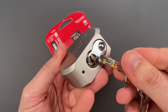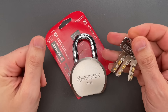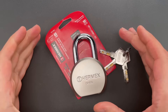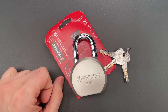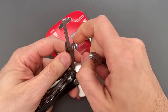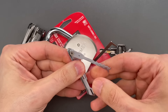But what sets this one apart is the dimple core. And between the spring tension on the core and the more extreme bitting of this particular lock, it seems pretty unlikely we're going to rake it open. So the question arises, how would I open this with my everyday carry picking tools? We're going to take out my riv pick from the Covert Companion and use the short hook as an improvised dimple flag. We're using the 50 thousandths thick turner, and let's get out that short hook.